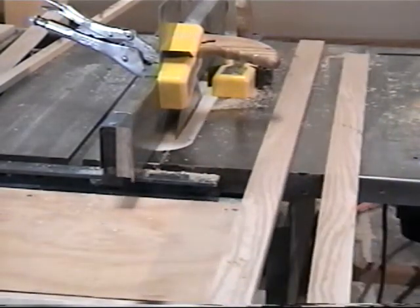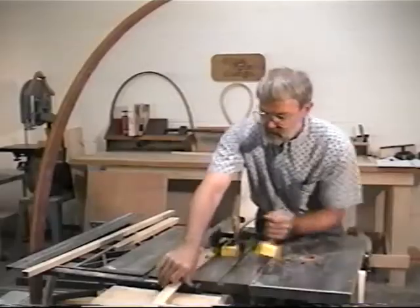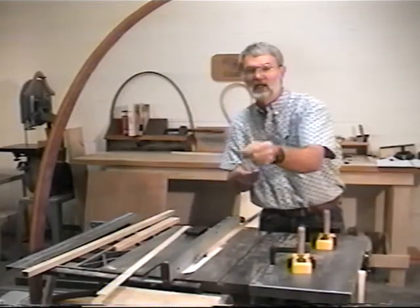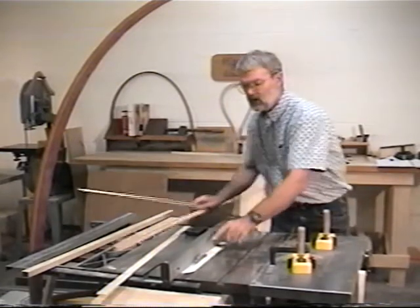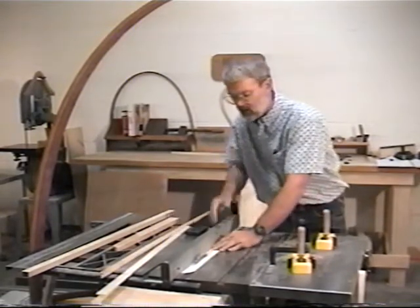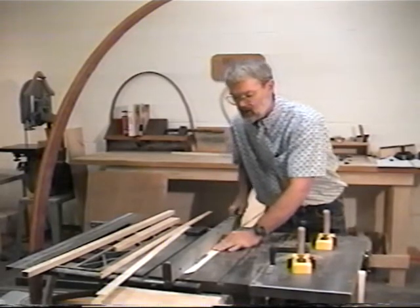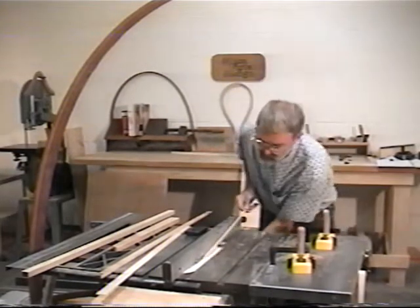Pull on the veneer rather than the thick piece. You'll get better cuts. You can even cut really little pieces if you want to. You need a zero clearance throat plate to cut this piece because you have to support it on both sides. Run your blade down low.